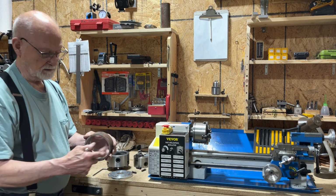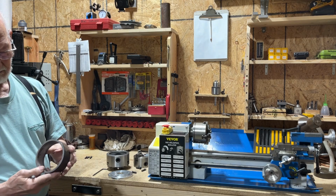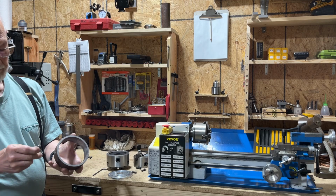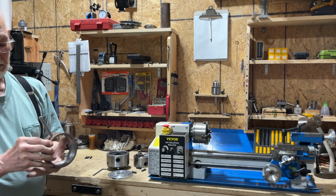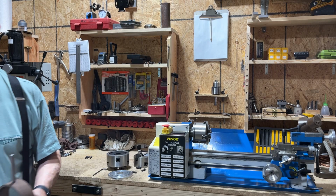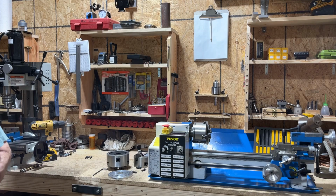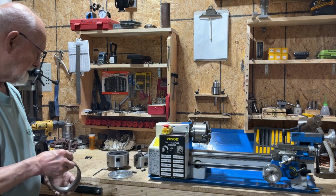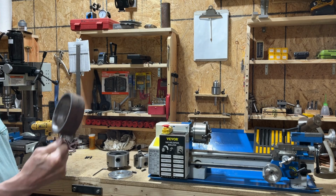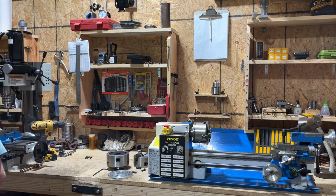I need to turn the outside down of this one and also on the inside, because the pipe that I used for making this was flash cut on the inside and it's a little undercut. So clean it up. This goes on, gets welded to it. And that goes inside of this piston. And that's what will be driving the drive shaft rotator whenever it's attached. So for now, let's go ahead and start on trying to get that.